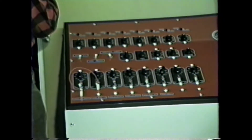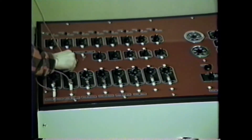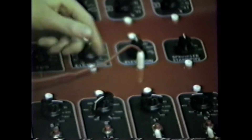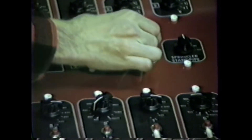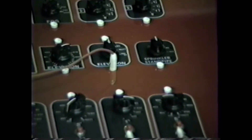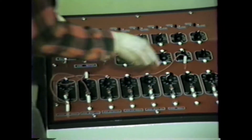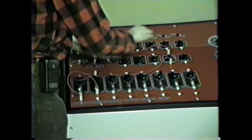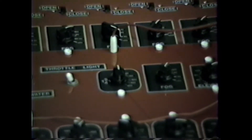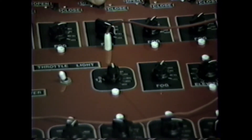From there, I'll run it over to an elevation problem, which I'll dial in anywhere from 30 to 120 feet. In this particular situation, I'll call for 30 feet. From there, we'll run over to a fog nozzle set at 125 gallons per minute. We'll have the nozzle closed.